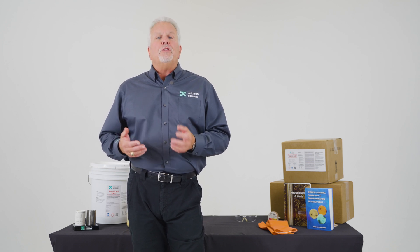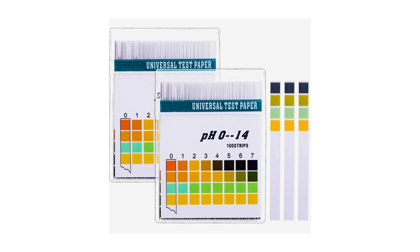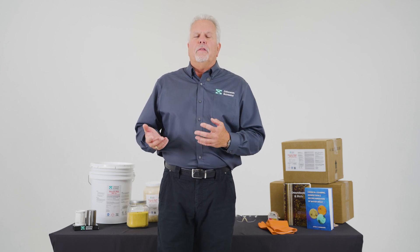The final consideration is to flush the system fully and use pH test strips to determine that the produced well water returns to the original pH reading, usually between 6.5 and 7.5, before reconnecting the well's service line to the storage system and to the house. When the dissolved mineral scale and introduced chemistry has been evacuated from the well and collected at the surface, we recommend using our neutralizer, NuWell 600, to bring the pH of the discharged water up to a safe level for disposal. We also recommend contacting your local government agencies for additional guidance and restrictions in your area as to the proper disposal of your well's flush acid returns.